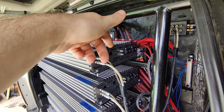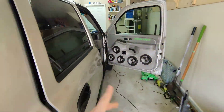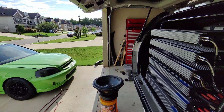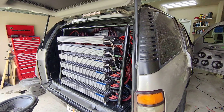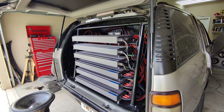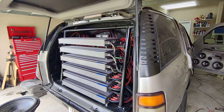Some people will turn it all the way up to 180 degrees if their subs are inverted, or instead of turning all the way to 180 degrees, you can just flip the wiring on your inverted subs — positive to negative and negative to positive. In my case, these subs are reverse polarity. If you were to play a 20 Hz tone right now with all six amps playing, and you hooked up an o-scope to every individual amp at the same time, you would very likely notice that the sine waves are going to be off ever so slightly. That's because you're running multiple amps and they're not always exactly spot-on as you'd hope. It can also be due to your enclosure itself and other issues like that.